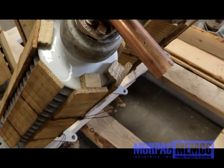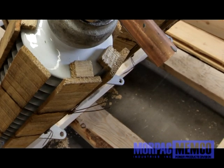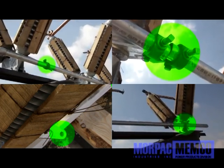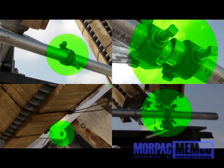Now that you have completed some initial testing of the arc horns or the whips, as the case may be, it is also highly recommended to install the clevises on all three phases while the phases are still at ground level. This will be an easier installation than doing it after the fact when the switch or the phases are installed in the elevated position.